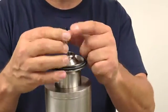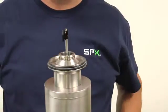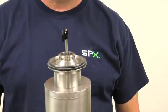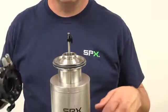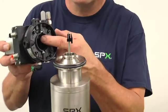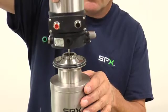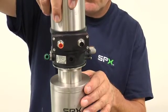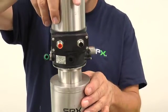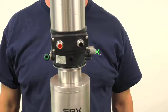Install the target puck sensor on the positioner stem by sliding it in place until a click is felt. Be sure to orient the puck sensor correctly as shown. With the positioner head in hand, locate the targeting tracks inside the positioner and orient the sensor puck so that it will ride in the tracks while placing the positioner onto the adapter. It is critical to the service of the positioner that the sensor puck is set into the guide tracks. This is a common troubleshooting step if the positioner causes faults.